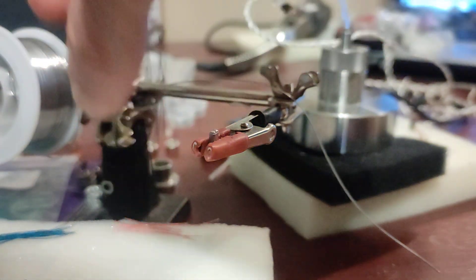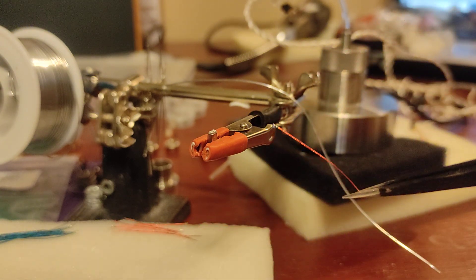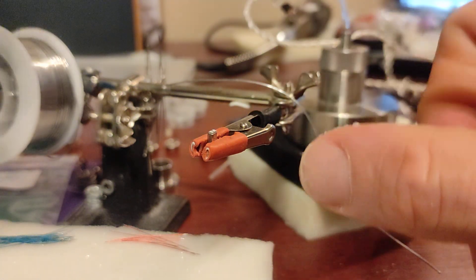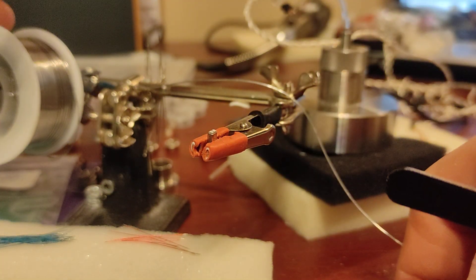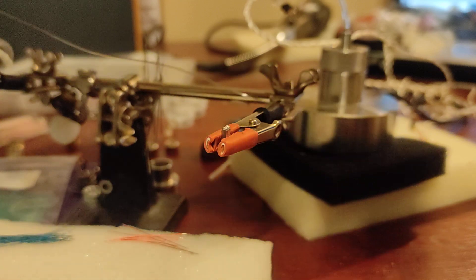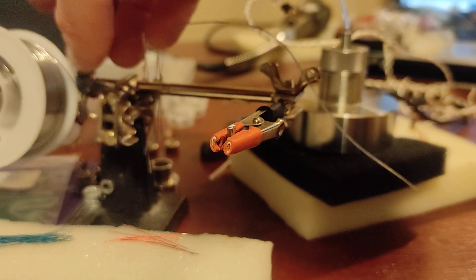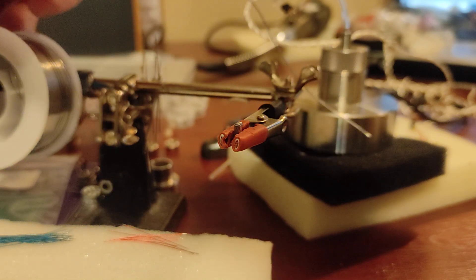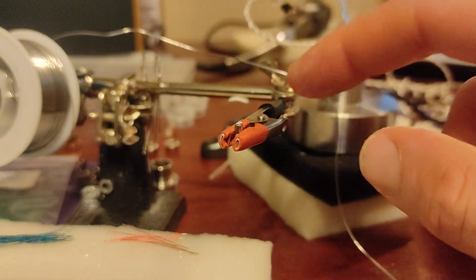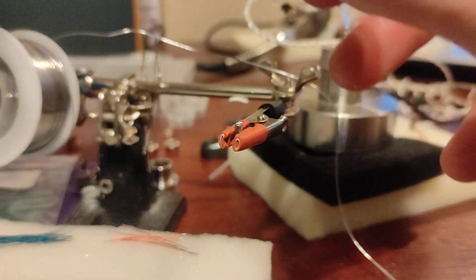You're going to want to grab your wire. You're going to need tweezers too. So you'll need tweezers, a pair of helping hands, and a soldering iron. You'll need good solder — this is 63-37, so 63% tin and the rest lead. You're going to need helping hands, soldering iron, solder, and stuff to clean your soldering iron. You can't just use a piece of crap.